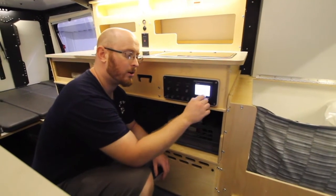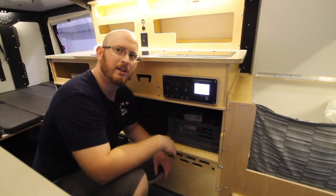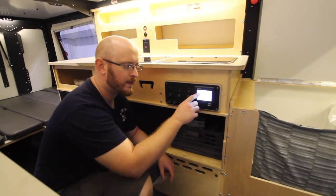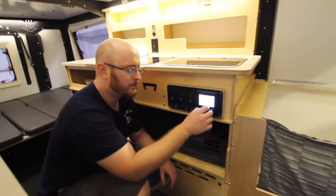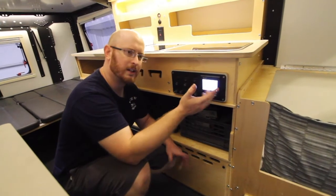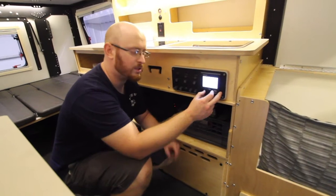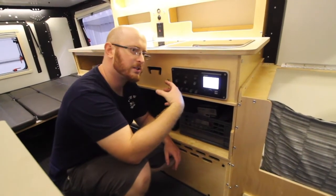I've moved over to the little house icon — I'm going to select that. Right now it's off. I'm going to set up the temperature of the house I want — set it high to heat it up, and once it reaches hot enough, I'd recommend pushing in again to bring it down to the set temperature you'd like. Push in again to select. Seeing that this little flame is on indicates it's operational. Now we can start to run our water heater as well — you don't necessarily need the furnace on to run the water heater, like in the summertime. Click it on: we have eco — which heats water only when it sees demand of flow — then hot, then boost. I love hot showers so I'll need it on boost.